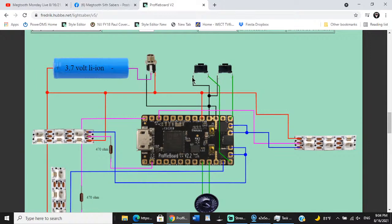And you see our ground wire, common ground to both switches. When I say common, I mean the wires are going to the same place. Now you can combine these wires wherever, and if y'all remember from video number 2 of this series, instead of me wiring 2 wires off our switch legs, I just twisted the switch legs together, soldered them together, and ran 1 wire off. So that was my common ground. It didn't matter if you join them outside or on the switches, it just doesn't matter.